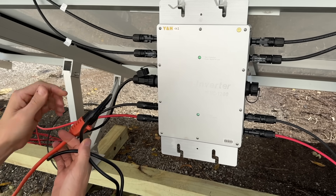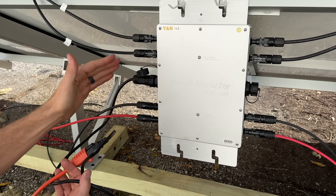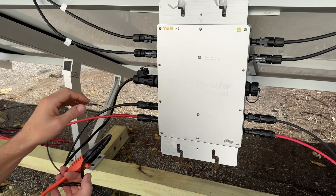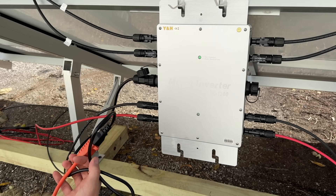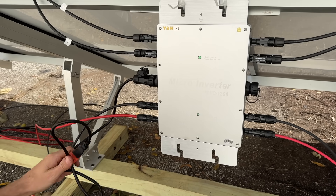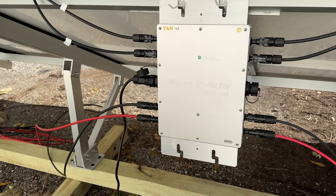Then you just go to your 120-volt plug. The big difference here is we have 120-volt output, compared to an Enphase microinverter which outputs 240 volts and does not claim to tie directly into your electrical system without the addition of a combiner box and proper disconnects in your home.